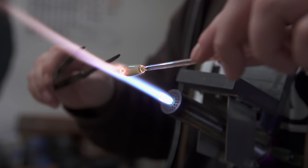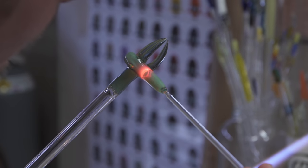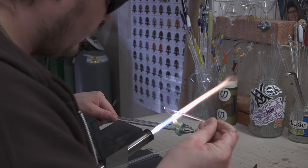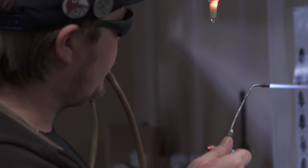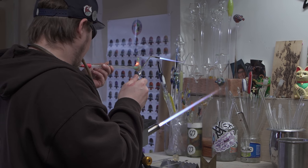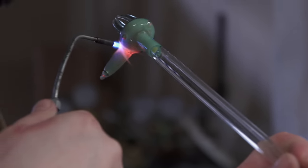Just getting in there with one blade of our tweezer jacks to open up that hole. I don't have anything convenient to bridge to, so we'll just go ahead and four corner this weld. Heat a little bit at a time, puff it out, wait for it to cool, then move on. It's really more important to just not blow it out too much because it's such a small area. We don't want to change the shape of this weld. Keeps it nice and small and looks more aesthetically pleasing. A nice preheat. Pop those three perk holes.